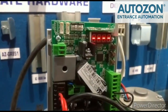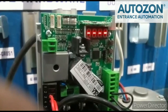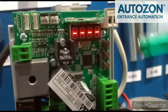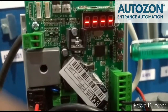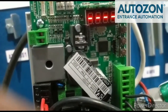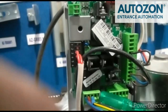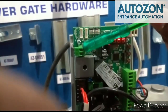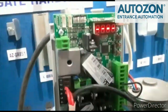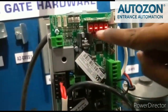Hi friends, I am explaining about our DC motor, with an operating voltage of around 24 volts. First, let me explain the overall board. This is the display menu and we can see three buttons. This is the configuration button, and this connector is used to externally connect external devices like cell keys, push buttons, etc. The motor connection should be connected using this connector, and these two terminals are available for the 24 volt supply. This black connector is used to connect a backup battery.